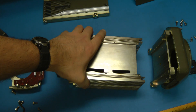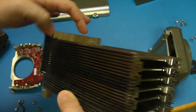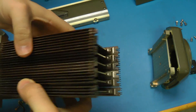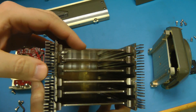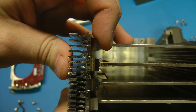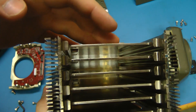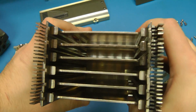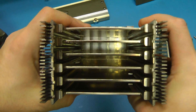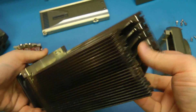So clearly one of the major issues in this design was heat, because all of the internal boards are mounted on these cards which appear to be aluminum extrusions. They have heatsinks down the edge, and the fan on the back blows air around them and out through these little holes on the side panel. This is actually pretty good design because it keeps all of the cooling air off of the cards — it doesn't blow air directly over them, so atmospheric contaminants don't get onto them. There are also little S-shaped curves where the cards join, which make a harder path for water and dust to get into the body of the camera. Based on the number of heatsink plates it had at least six cards, and possibly as many as 12 if PCBs were mounted on both sides. The datasheet says the power supply is 90 watts, so it does dissipate a good amount of heat.